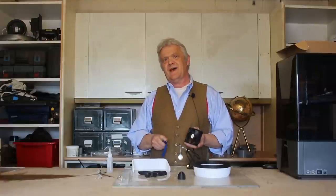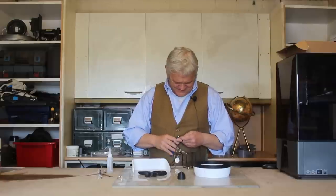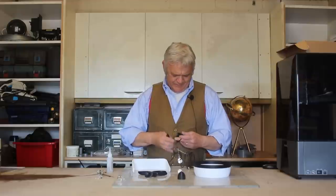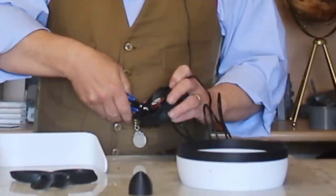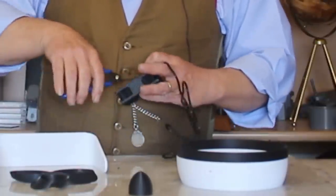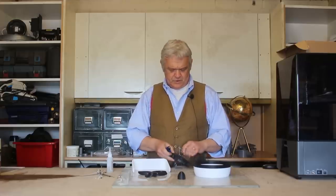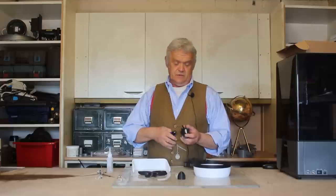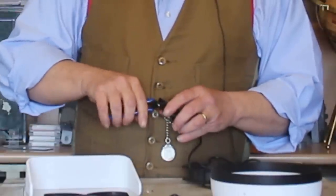When we've sliced through, the fan goes right on there. Now we need to separate the fan motor out. If you've got a 3D printer you've got snips — just snip around everything, obviously best not to snip the wires. Snip it out, remove the center section by snipping close to it — there are four supports, snip them off and the fan will drop out. Then remove the blades by snipping them — they'll just fly off.